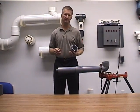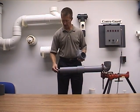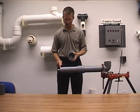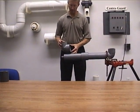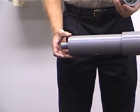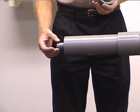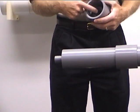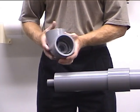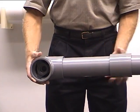When we're doing a change of direction, we're going to have to do what we term a simultaneous solvent cementing procedure. In this case, we're going to want to make sure that our carrier pipe is sticking out the proper length beyond the containment so that when we put this fitting on, the carrier pipe is going to bottom out properly and the containment pipe is going to bottom out properly. We're going to apply primer to both spigots — carrier and containment — both sockets — carrier and containment. Apply solvent cement to both spigots and both sockets, come into place, rotate it, and our joint is made.